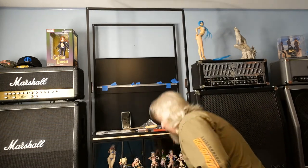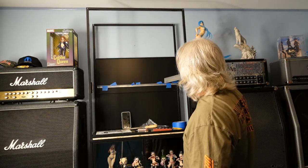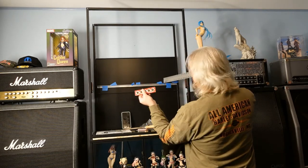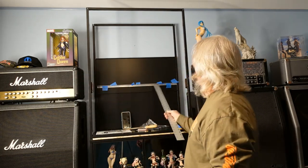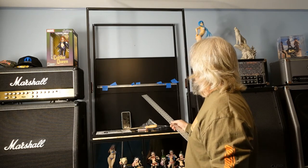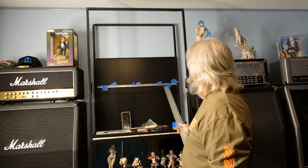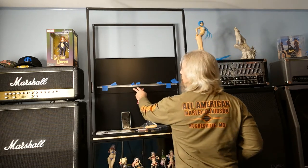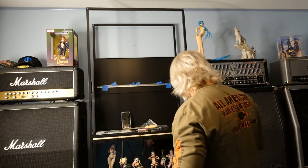So what I did, took a straight edge, and off that little piece of wood that I had, before this was even here, I took my level and I leveled it, and I made a mark. Repeated the same process over here, made a mark, drew a line, and as you can see, I have this piece of aluminum L. It's an L shape. I cut it to size, I filed it, and temporarily taped it up there while I was holding my hand here to keep it from going anywhere, because this tape ain't but so strong. Went ahead and laid that glass in there and then did the little tap test, to make sure everything was going to sit right.